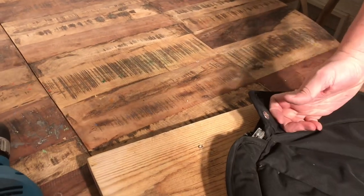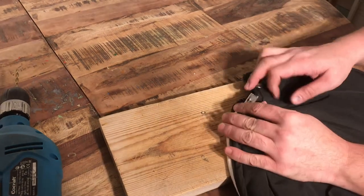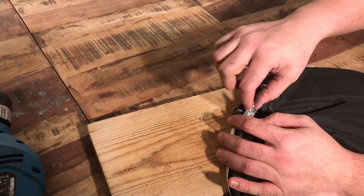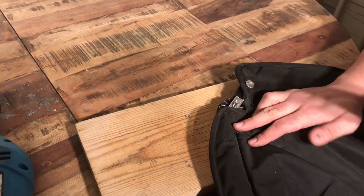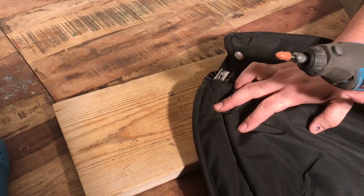There we go. Now you can, with a little bit of effort and being careful, push the rest of this rivet down through the other pieces — but the end of it is a little bit enlarged, and it'll be easier and do less potential damage to the metal bits if you use a Dremel or something to sand it.